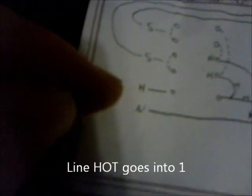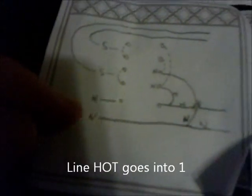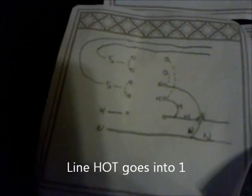So the solution that I had when I wired this was not to wire the neutral into any of those sets of things, because I just couldn't get it working. So what I've got here is, remember, the bottom set is something that goes on when it's to the left or to the right. So that's going to be my break and hot. I want to make sure I know my hot in, because I don't want my hot going through the motor and through the entire switch and then getting broken on the neutral side. So make sure you get the hot wired in here, but I'll wire the hot to that, and I'll bypass the neutral by the switch entirely. I guess that'll be okay, because at least it will disconnect power.